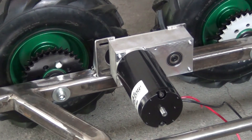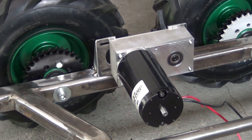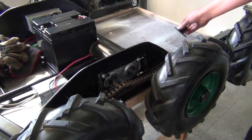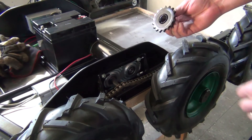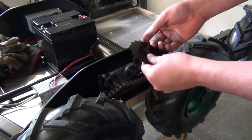The other motor is still in place so you will get the idea of how they will be mounted — they can travel about an inch back and forth to get the chain tensioned. The drive mechanics are almost done; the last thing I manufactured was this sprocket for the motor end.